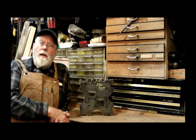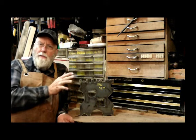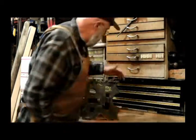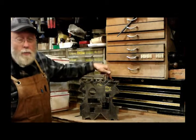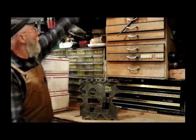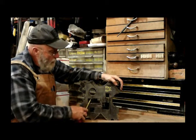So what I'm going to do is, instead of giving away that swage block which is already sold, I've done away with the drawing for it and changed it to this one. This is the new hardy or swage block. The outside is the same as the other one, but what I did was I put in a one-inch square, a one-and-a-quarter-inch square, a two-inch square, a two-inch circle, and then this slot here is three-and-a-half by one-and-a-quarter.